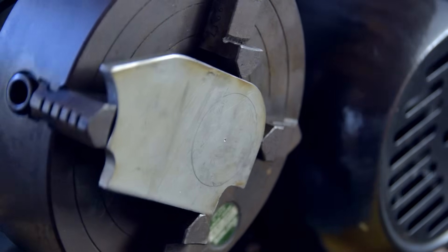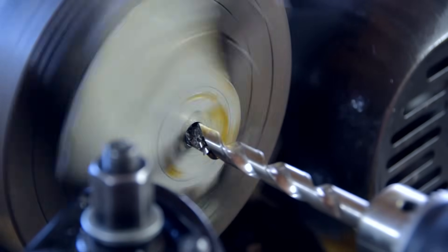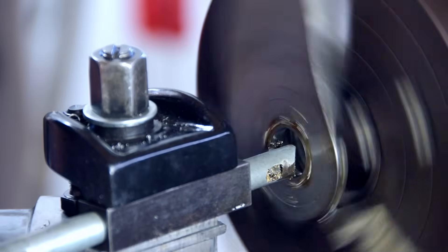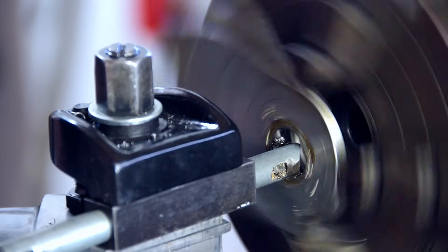I need to make a hole and a three millimeter recess. This setup is a little precarious for the MDF versus stainless steel — I was worried that the piece would move, but the high-speed steel cutter actually went pretty well against the stainless.